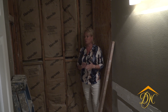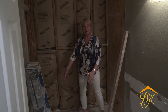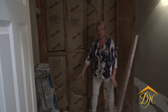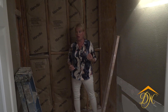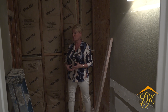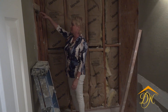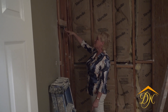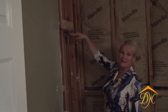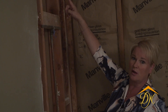What we're doing here: this had a tub and shower unit in it, but we're actually just going to make a standing shower unit. We're going to put a three-inch curb in here, put some nice barn-style oil-rubbed bronze doors in here. We're also raising the showerhead — I'm only five-foot-four with heels on, and look where that head is versus where my head is. We're raising it up at least 12 inches.